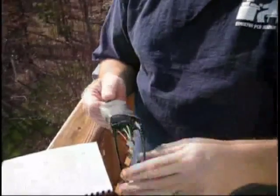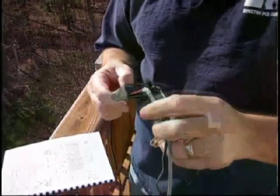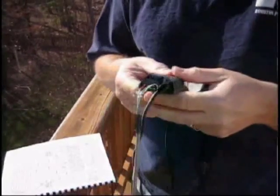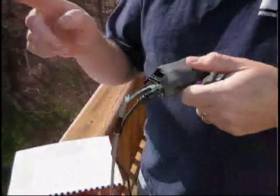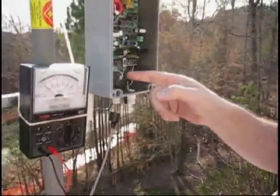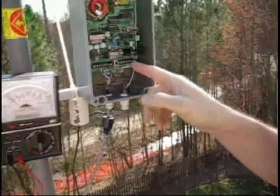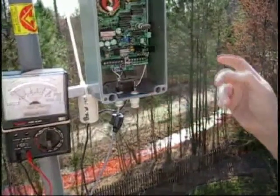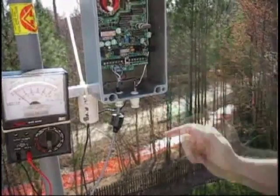This is the new audio power adapter unit, and this eliminates a lot of problems with impedance matching and level outputs. The cabling of the transmitter is simple: at this end, power, ground, and audio just go right into the terminal block. At the other end of the wire, power, red plus, and audio go right into the terminal block. The reason there are two terminal blocks and two holes is for multiple transmitters — like if you're putting a transmitter down the highway every so often, you can go cable in, cable out.